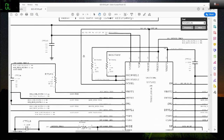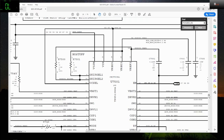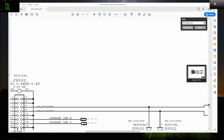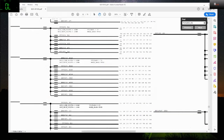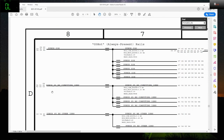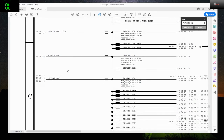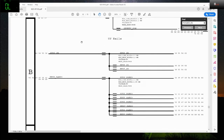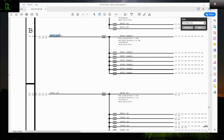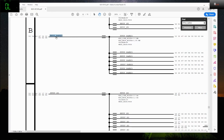I checked from ppbus_g3h to ppbus_s5_hs_computing ISN — it's present, everything present — until I got to the point where PP5V_S4RS3 is missing.